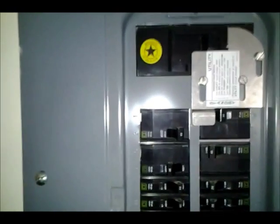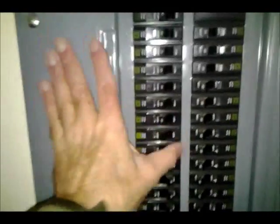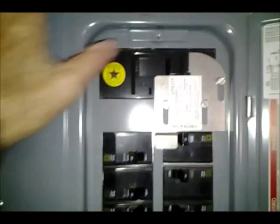Here's my John Deere tractor with my blade on it — if you want to see a video on that, click on the link. Here's our power panel. These are the lights in the garage in the bottom right here, which I just turned off and turned back on. The first step is to turn off all the breakers in the panel. I put a star by the ones I think should possibly be turned on with the generator — that can vary over time, and those are temporary stars. My generator breaker is labeled here with a temporary piece of tape.